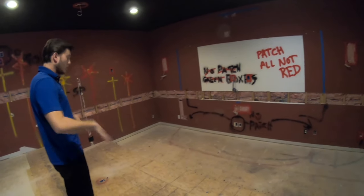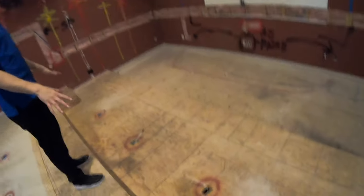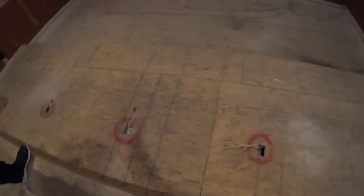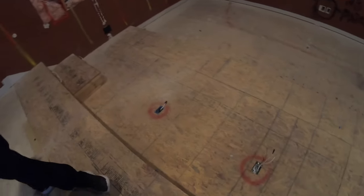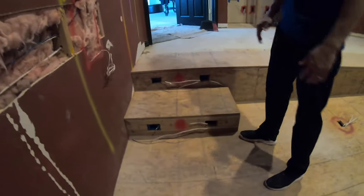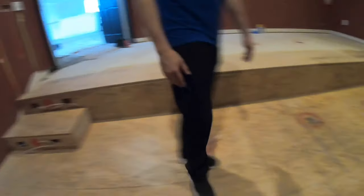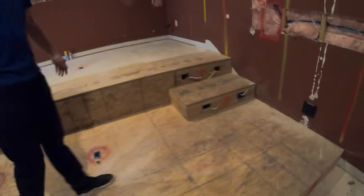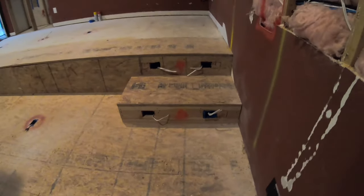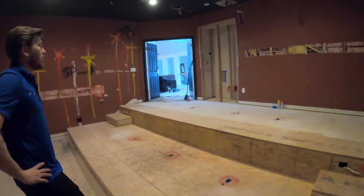We're also doing electrical and plugs down here on the floor for the seating — we just line these up right underneath the seats, five per row, so they can plug right in. For step lights, this is a pretty deep drop-off here so we want to make sure the customer is safe and guests don't trip and fall. We're going to be putting in four step lights here and another four step lights over on the other side — we still need to put a couple of boxes on that but we'll be back for the electrician tomorrow.